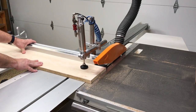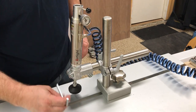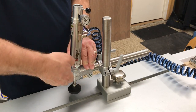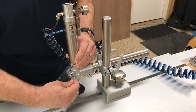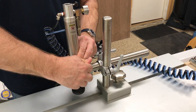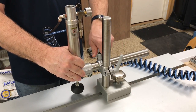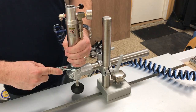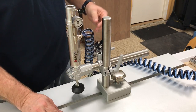Here is a demonstration of crosscutting some hardwood with the edge against the fence. The clamps are set from the factory so that the foot comes down onto the work piece at an angle, which helps hold the piece against the fence. However, if you prefer, you can change the setting so that the foot is applying pressure straight down instead. All you have to do is loosen the bolt shown, which allows you to rotate the cylinder to a vertical position in relation to the clamp support. Loosen the locking lever to rotate the assembly until it is vertical on both planes, and then use the supplied wrench to loosen the nut shown to rotate the cylinder. When you tighten up this nut, just snug it up — you don't want to over tighten it.